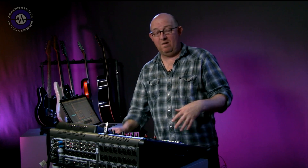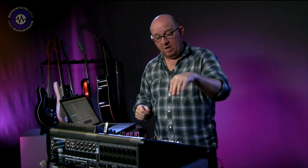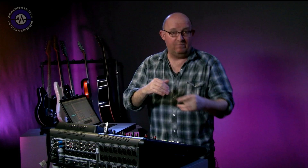There are quite a lot of other tweaks that have gone on — I'm not going to be able to go into all of them here, but they've been thinking about this quite a lot. A few highlights: it's now possible to route to the XLR outputs directly from input, so we don't need to use up a channel, bus it, and then send a bus to one of the XLR outputs. That's handy for routing all sorts of things, particularly when you've got the AES50 and external stage boxes that we can pass audio through to other places.